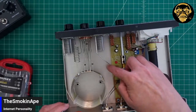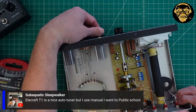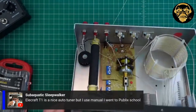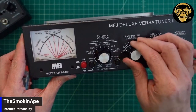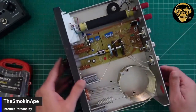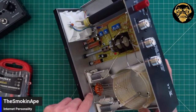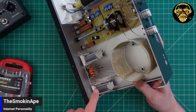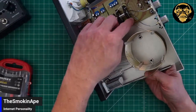You can follow the traces and it comes out, goes into this side of the capacitor. You can see I adjust the capacitor with this knob here. This is fully open — and just like Hollywood was saying, it is 110, so fully meshed would be at zero. The other side of the capacitor has this wire that goes right over into the other capacitor, forming the top of the T. And this wire comes over here — it looks like it goes into the coil, but it's above the coil, and it comes down and goes back into the board.